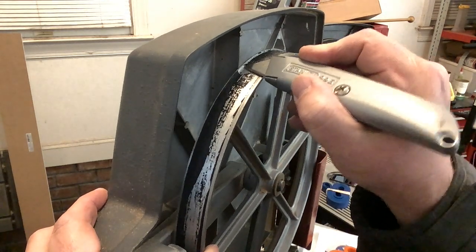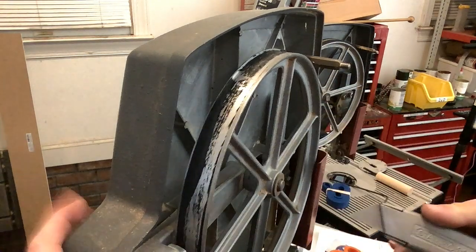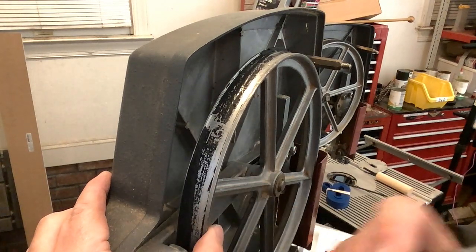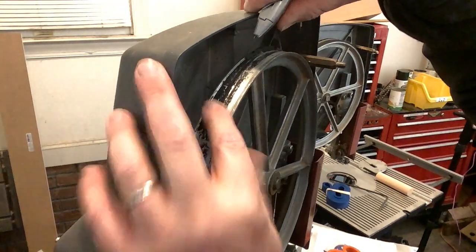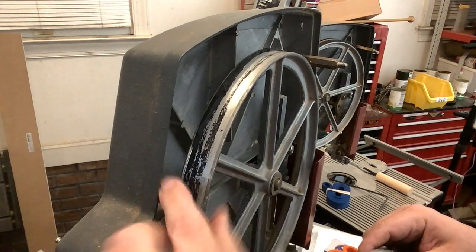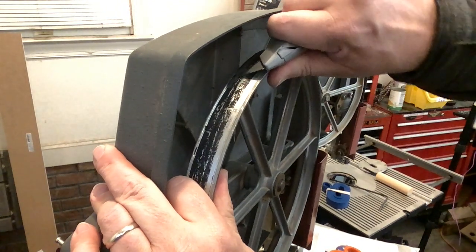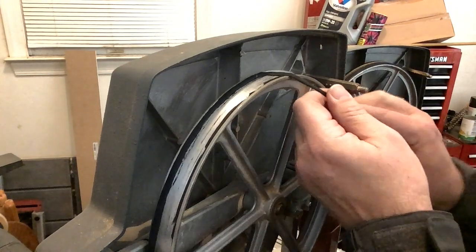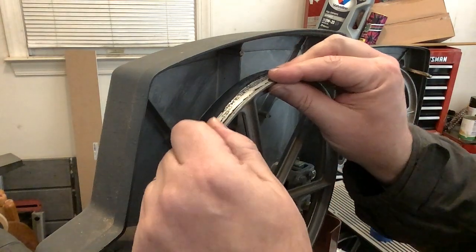I'm protecting my hand behind the back of the bandsaw and running a utility knife underneath the tire, right to that back shoulder. Keeping my hand safely blocked. You might also want to get the blade in there and run it against the back rim to get it to come loose — it's just a matter of muscle at this point. Making that undercut is helping pull it away pretty cleanly.